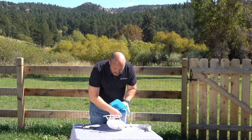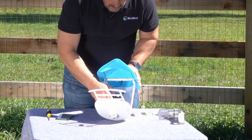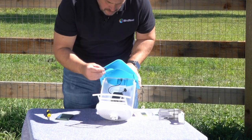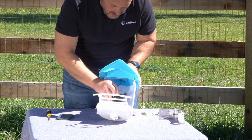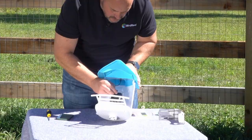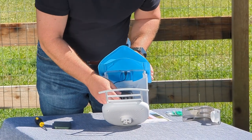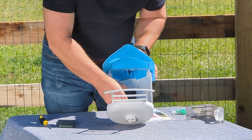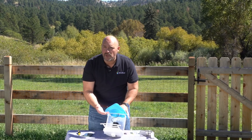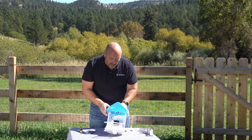We're going to make sure that the cable that comes from the solar panels is connected to the top of the camera. The first thing to do is make sure that we put our rubber cover over the switch because that protects it from getting any rain inside of the holes here. And once that's in, we simply just connect the cable to the top of the camera. And from there, it will start charging from the solar panels. And then line up the camera so that it's got the right angle on the perch, which you may need to adjust even after you have it set up on the mount, which you can do using the app so you can see what's actually coming through the camera.